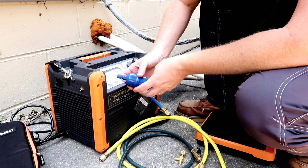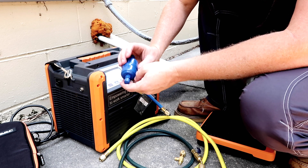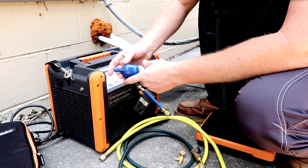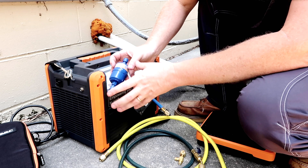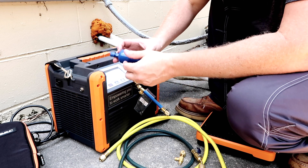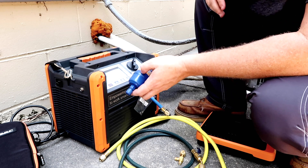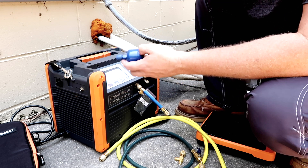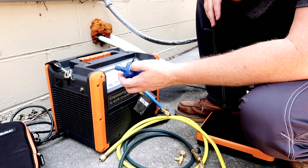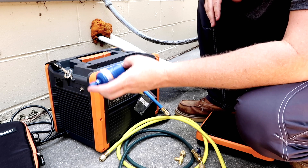On this dryer, you don't want to open it up to the atmosphere unless you're using it to kind of prevent it from being contaminated. This one is so small it may not have much desiccant in it, but you can really use any quarter-inch flare dryer for this purpose. I'd actually suggest getting a larger one — a typical size with quarter-inch fittings — so you'll get a little bit more flow through it. Another thing: when you actually charge out of your recovery tank, it's a good idea to charge through a filter dryer. There can be sludge in the bottom of a lot of tanks, and you never know what those tanks have been through. So keep a couple of these quarter-inch flare dryers on your truck — as they become contaminated and you start to see a pressure-temperature drop across them, just replace them.